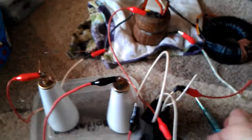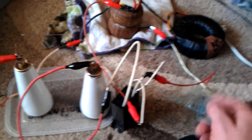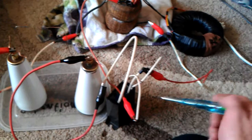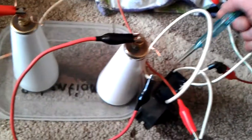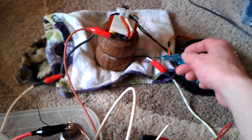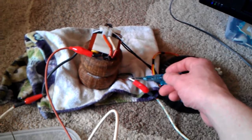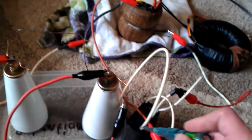So John, if you're watching mate, I'll show you how I wired it up — and for you guys too, if you've not seen one of these before, it's not really that hard to wire up. This wire just here, which goes around into the far corner here, this is a ground which goes to the core of the x-ray transformer. I'm putting 40 volts through this, by the way. And it's just this one here with a cap on it — this goes to the high voltage output, which is the filament output of the transformer.